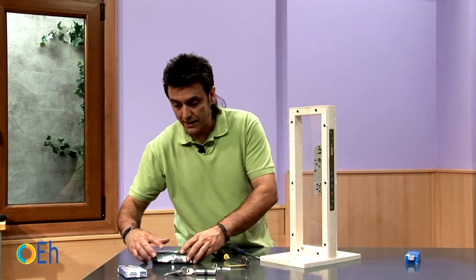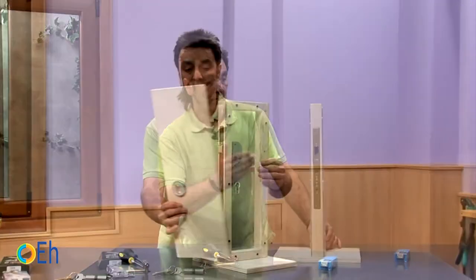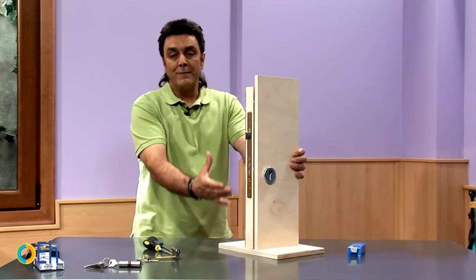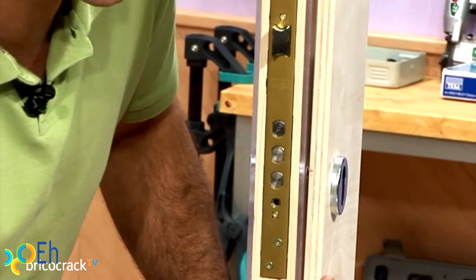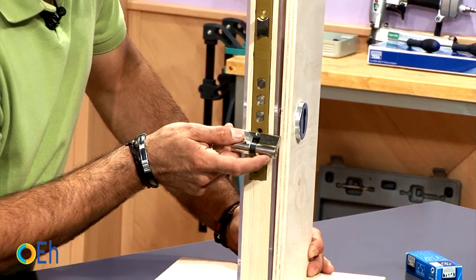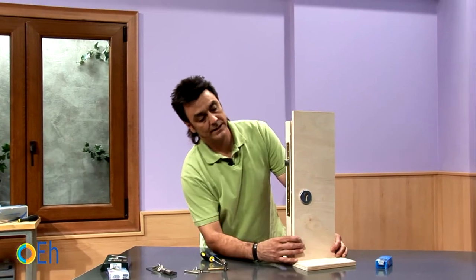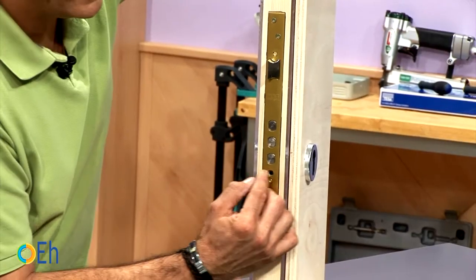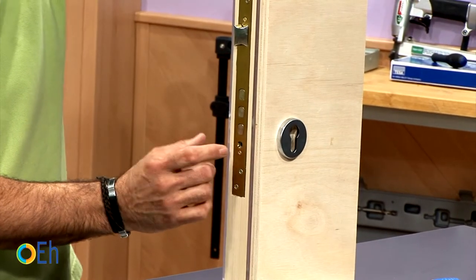Let's take it out and I'll show you another kind of cylinder lock. Occasionally we have increased the width of the door because we have done a covering made of wood or another material, fattening one of the faces of the door. In this case we're not going to be able to install the 30-30 cylinder because on that side the key is not going to enter — we need a longer cylinder. But if we put the length we need for that side, on the other side it's going to stay too long.